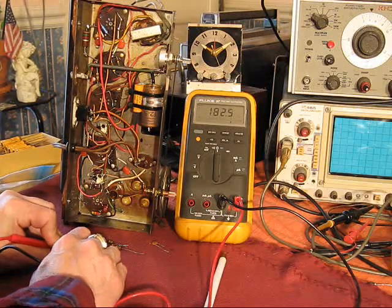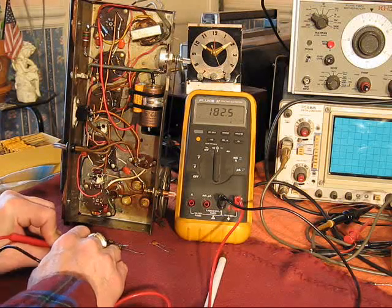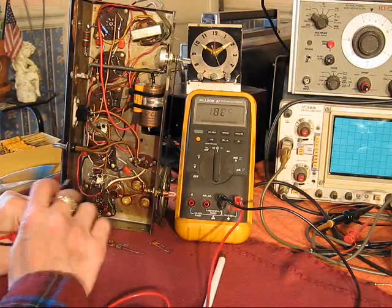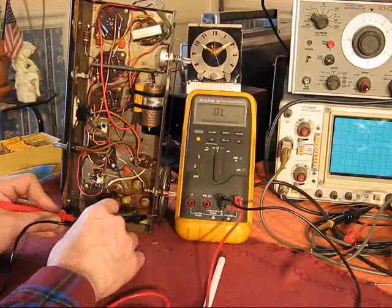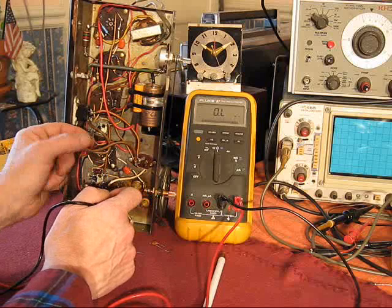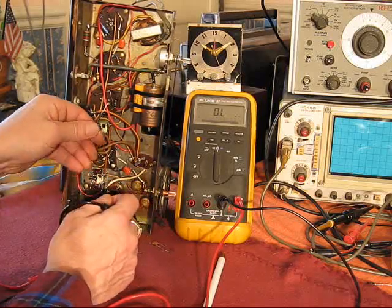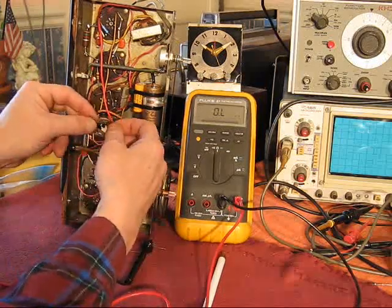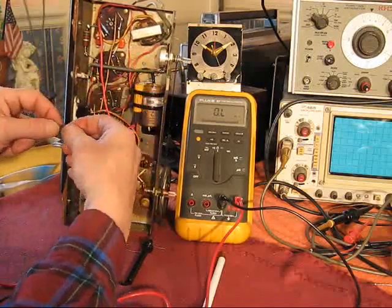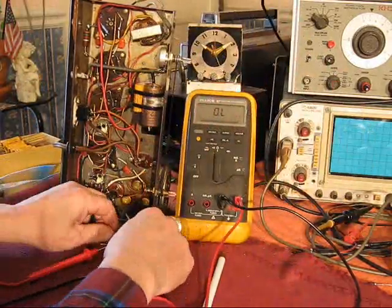182 ohms. Well, it seems a little higher to me. Yeah, the highest that should be is 165 ohms. The lowest it should be is 135. Anywhere in there, I'm sure it would be fine. And this was functioning, but is it moving? Is it drifting? Is it noisy? Probably. It's just aged beyond its useful life. And it was really not of a high enough wattage to put where they did in the circuit. It's just cheap. They're cheap, they want to make it. So out that goes.